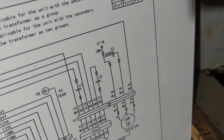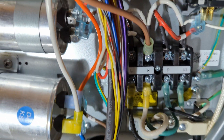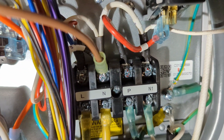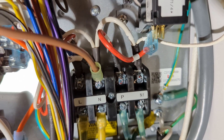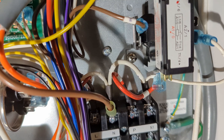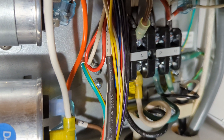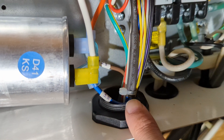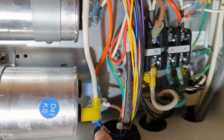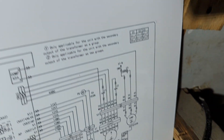On their diagram, 38 blue didn't tie back into the white. So what I did is I just added that brown wire to the neutral, which is number 5, spliced in with those two blue wires — one 48 goes there and the other goes out to the compressor.